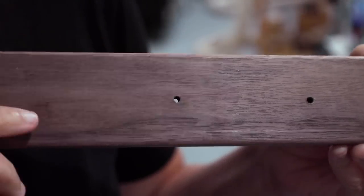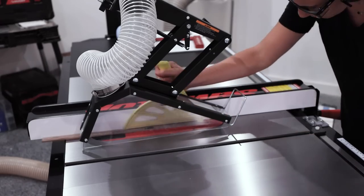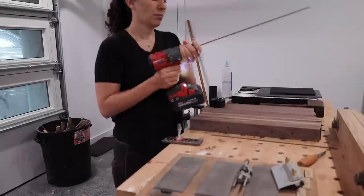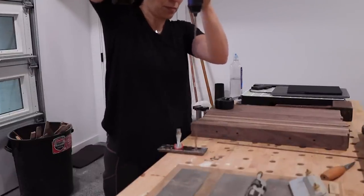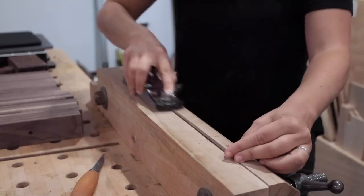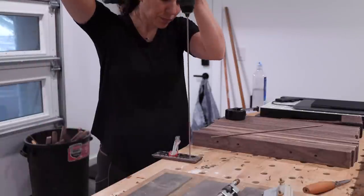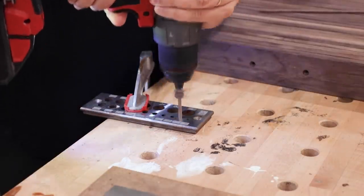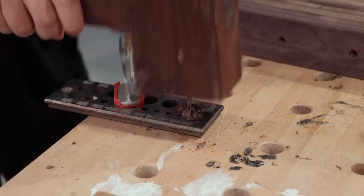Since these pieces were salvaged from my failed roll-up chair there were holes in them. I thought maybe I could use those holes to my advantage when gluing up, so I ripped an almost eighth-inch piece of walnut to turn it into an eighth-inch dowel — a fun challenge to see if I could make super long eighth-inch dowels without breaking them. I knocked off the corners with a block plane so the square stock went into my dowel plate perfectly. This was so fun and satisfying to do.